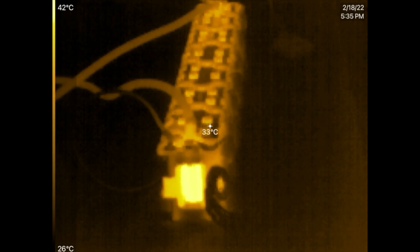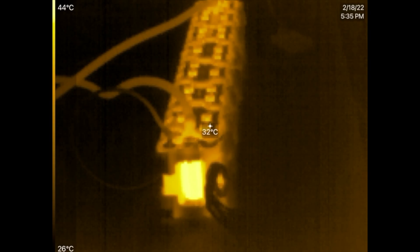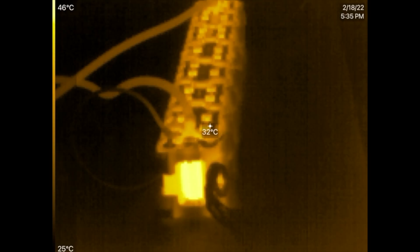Let's put the thermal camera. Look at those cells — they're looking mighty hot there. What is the temperature? About 40 degrees, so they're warm but not hot yet. This is a super low-res camera. We're still pulling 84 amps. One inverter is only pulling 300. Wait, the voltage is down to 44? That's really sagging a lot there. 43 volts. It's supposed to be 58. 42 is completely dead, right?